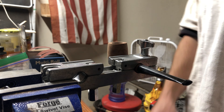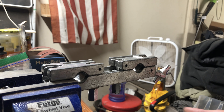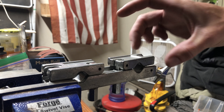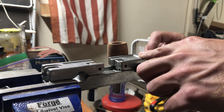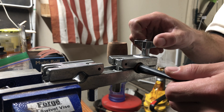Basically what I have here is a multi-clamp that was from an old drum set that I have, and it's just clamped in a vice. But you don't have to use this particular thing exactly — I think they're like 20 bucks. You can use any clamp type thing. You could even just put this in a straight vice; you'll just want to pad around the teeth so it doesn't dig into the pipe. Any kind of thing that you can use to hold the pipe stationary while you're sanding — even if you're not using the back and forth belt motion — even just having this here so you can go like that instead of working with it in your hands really does aid in the finishing process.